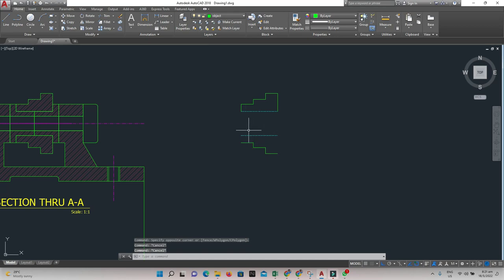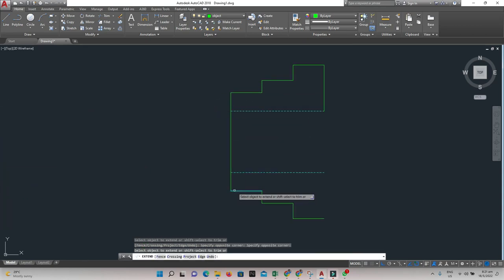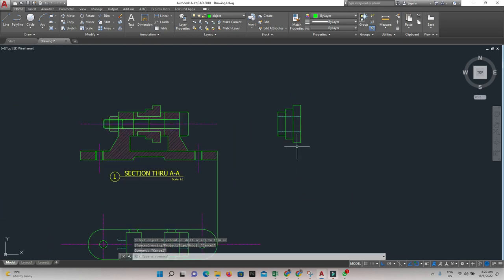All right. Then I'm going to fillet, or I could extend. Type EX. Extend this to that. To this. Extending this line here all the way. I'm also going to select these lines here. Well, not these, but the vertical ones as well, and then delete. I'm going to select all of these now and type EX and press enter, and then extend that and that down. Alright, extend them down. And that's what that will look like.